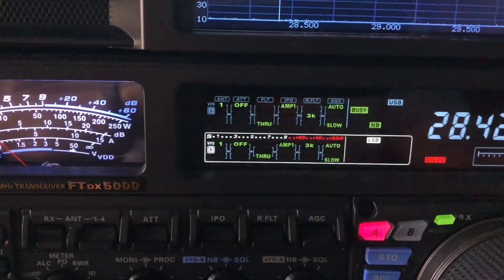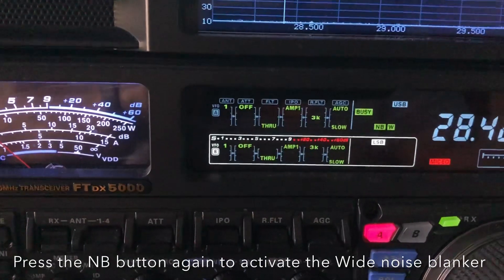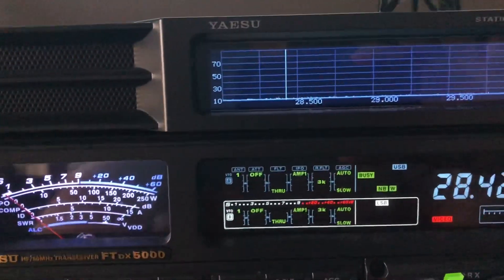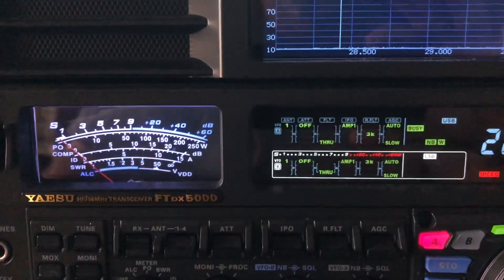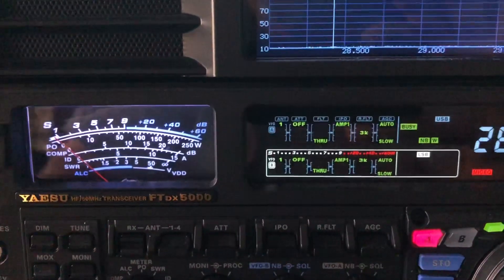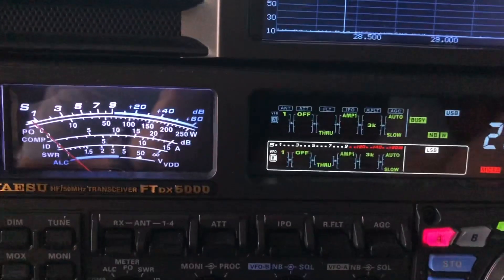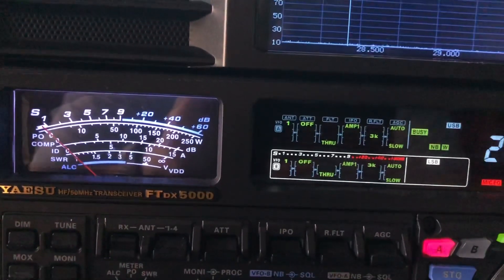Now there's a second one. If you watch my display right next to where it says NB, it's going to add a W to it. That's the wide noise blanker. And essentially what that's for is to combat things other than power line noise — it could be wall wart power supplies, wireless phone chargers, computer power supplies for a laptop. But only use the wide noise blanker if you have to, because it does have a tendency, especially if you set it at too high of a level, to cause distortion.